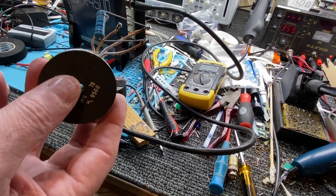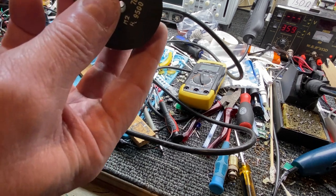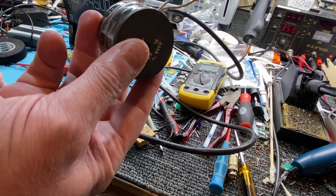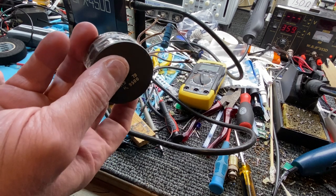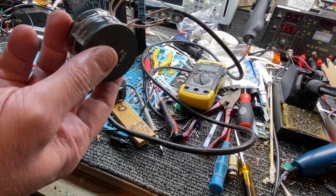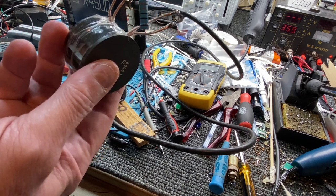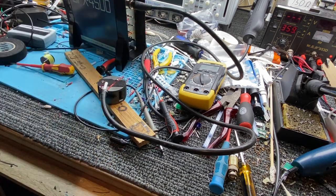I was using very low noise JFETs, impedance converting them down to an impedance transformer, dropping the impedance of a few thousand ohms down to probably 50 or 100 ohms, then feeding the audio back up on coaxial cable. I supplied power down the coaxial cable as well, and I had some piezo sensors in the bottom.